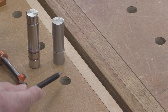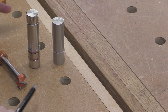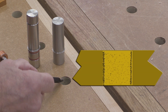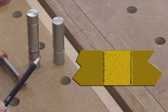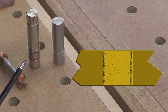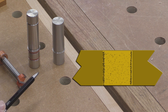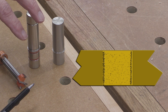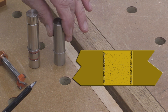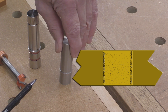It is important to understand the process that can cause a hole to become tight, or to be tight from the very beginning. It's all caused by fibre lining the hole. MDF in particular is a material that has a lot of fibrous little pieces, and if one were able to see it closely, you'd see that sticking out from the hole will be lots of little fibres pointing in towards the hole. If there are enough of them, it will make the insertion of a dog difficult.